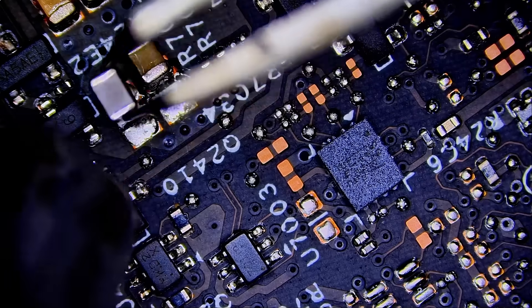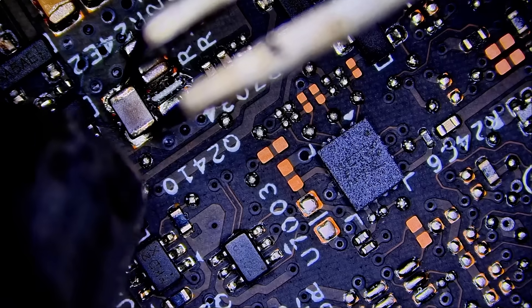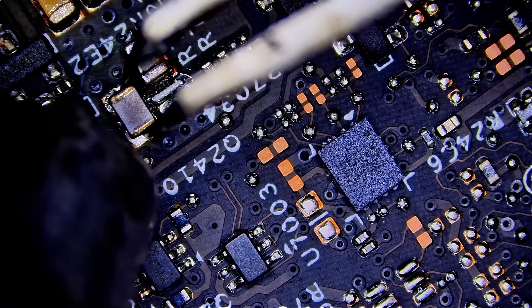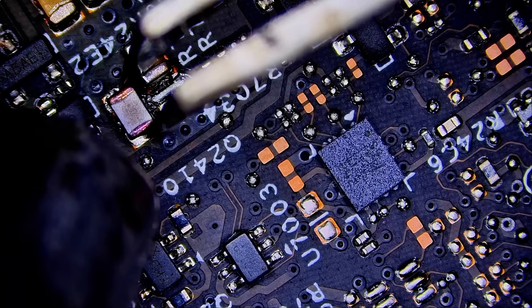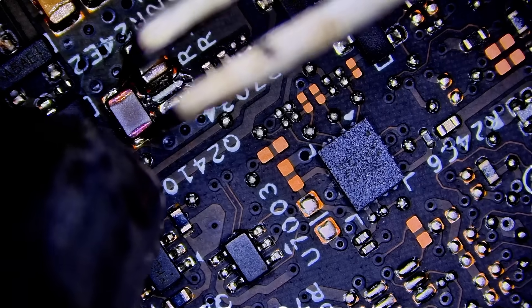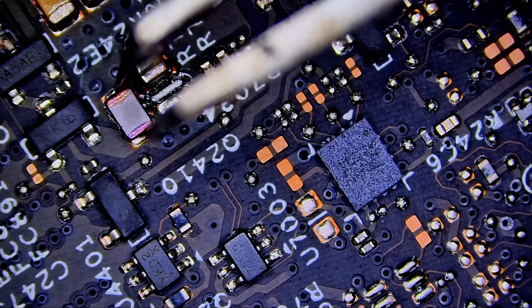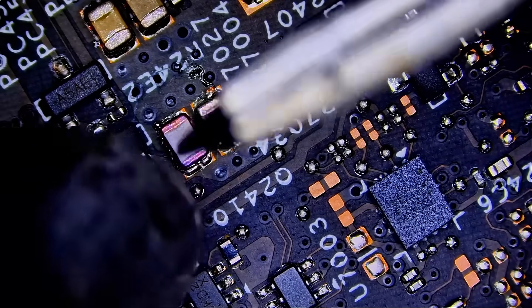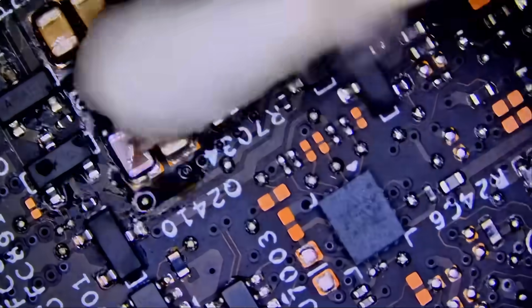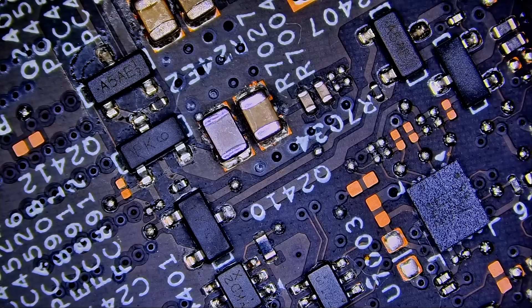See how I made that cap do some gymnastic moves. I did not apply any flux, I did not apply any leaded solder — we're just going to use whatever solder is on the board. We can teach this board a lesson so it doesn't do it again. We replaced the cap with a 10 microfarad capacitor at 60 volts. We are done — going to invoice and mail this back to the customer.